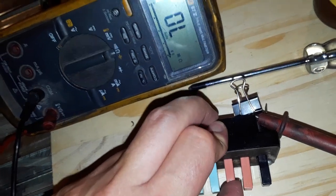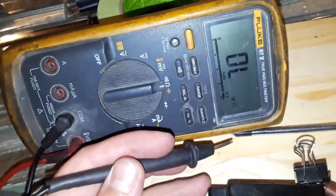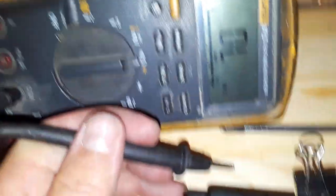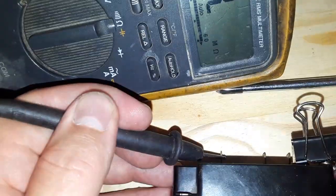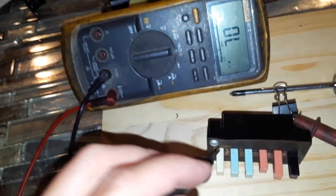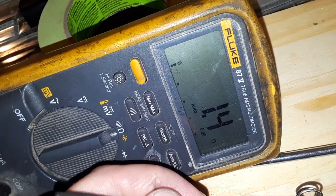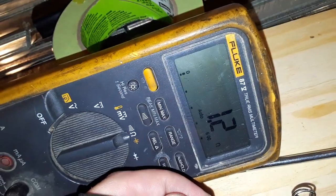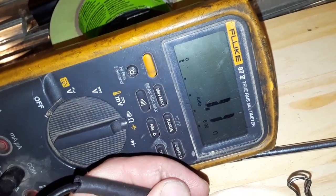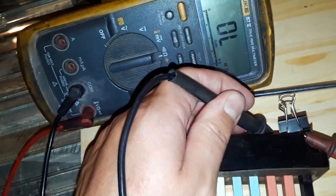We're going to put it on low fan — or low exhaust I should say, but it's a fan because it doesn't really exhaust anything. The compressor should still be reading off, and it is. Because I put this back together yesterday one time and the compressor was on all the time unless you put it in vent. The low speed should be made, which it is — that's still a dead short, a good enough contact. And the high speed should be open, which is crucial. You really want to make sure there's no continuity on both fan speeds at the same time — that could be catastrophic. If the compressor contact malfunctions it's really not that big a deal; worst case the compressor is running all the time but it's not going to damage anything.